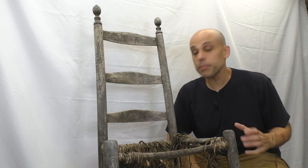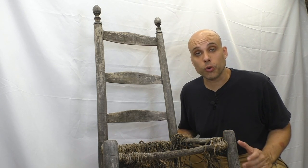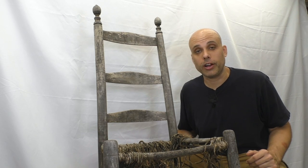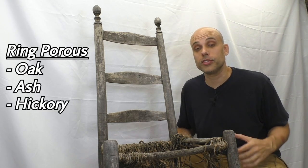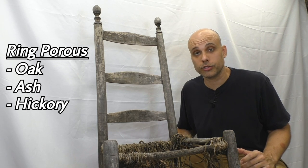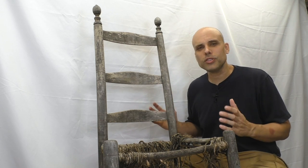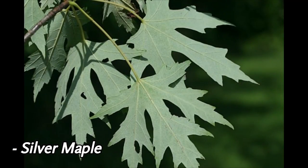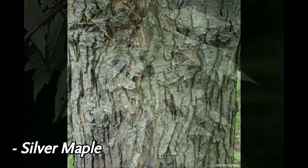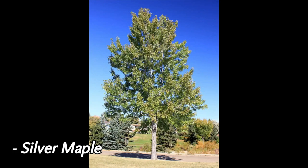What's unexpected is the choice of woods. Ladder-back chairs like this were almost always made from tough, springy, ring-porous woods like oak, ash, and hickory — the woods most modern chair makers concentrate on. This chair has a little oak, especially in the seat rungs, but most of it is made from silver maple, which is a very weird choice. It's a really soft hardwood — not springy like oak or ash, not known for splitting well, and not particularly good for bending.